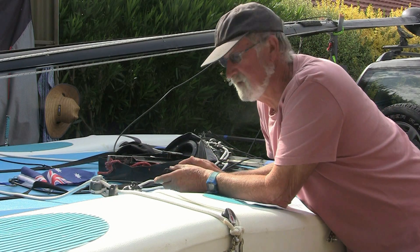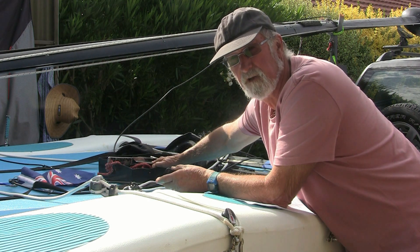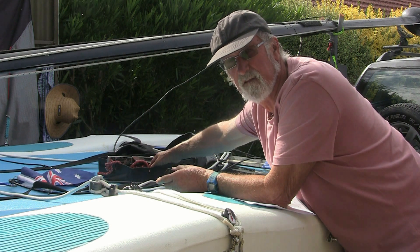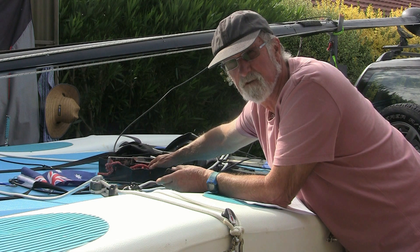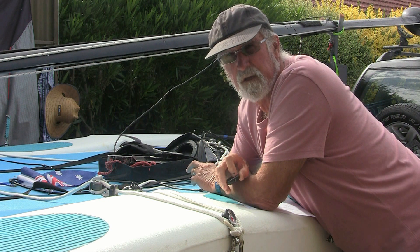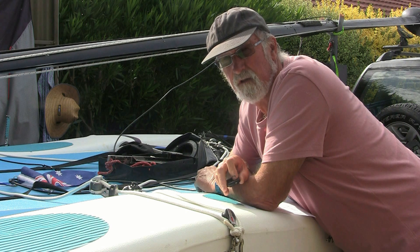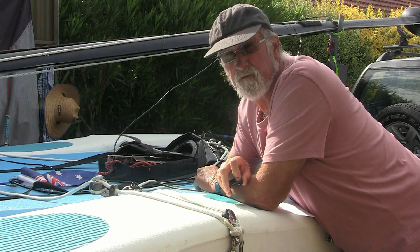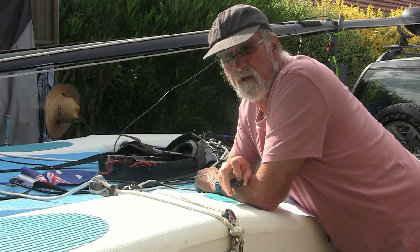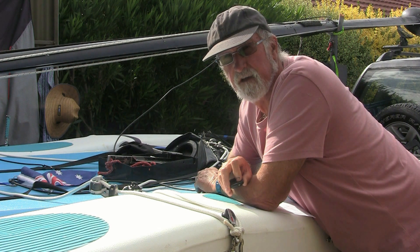The anchor needs to be sitting on top of your rope, not under it. In the event of a capsize, the anchor goes over first and then the rope follows it. I've never pitch-polled this boat — I've only capsized it four times. In the event of a pitch pole, if you had a jib the anchor may become entangled in the jib, so I'm not quite sure how it would work in that scenario. But it definitely works if you have a capsize.